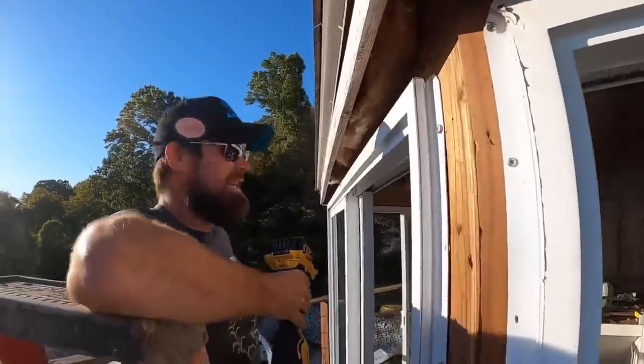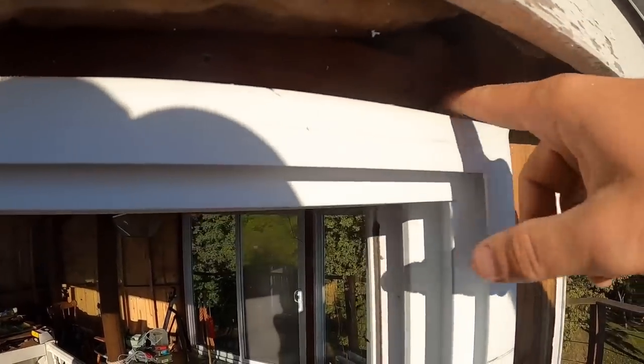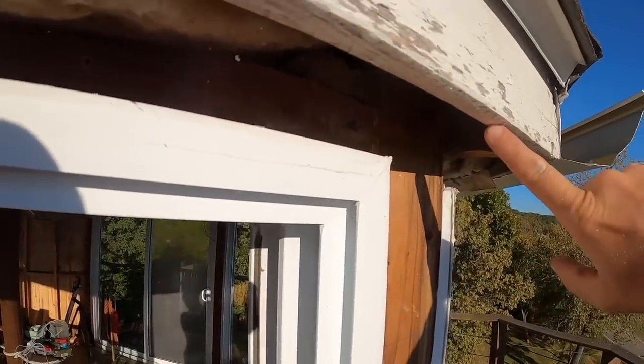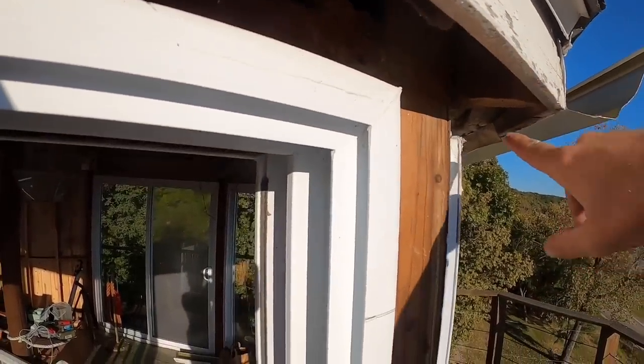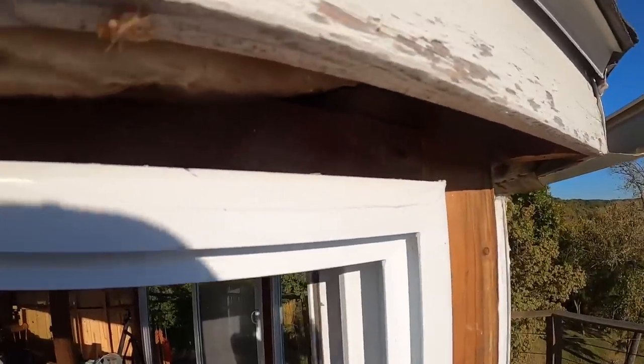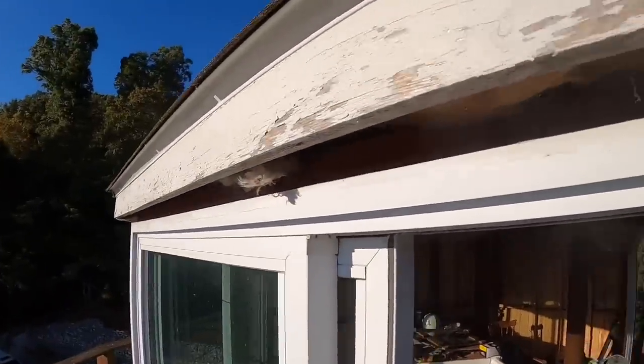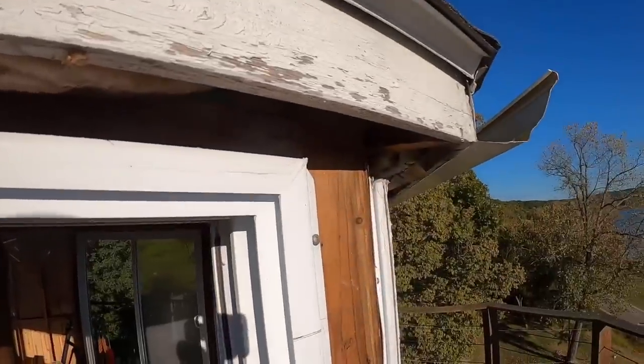And just like that, the plastic is now off, as you guys can see up in there. And now we'll be able to run that bottom board all the way over to the wood, attach it here. And we may even throw some toenails into that board there, depending on how well. Probably gonna have to wait until the door's out to do that. But anyway, we're gonna get this stuff attached. Maybe put some gutters on yet.